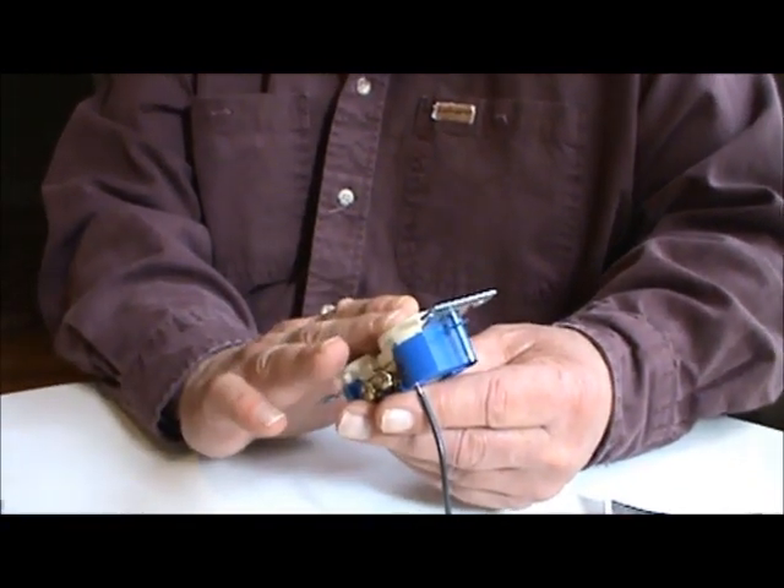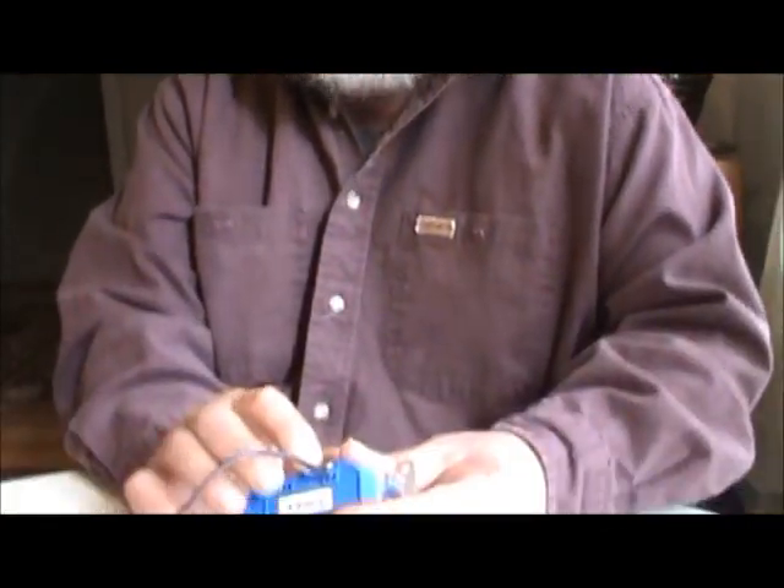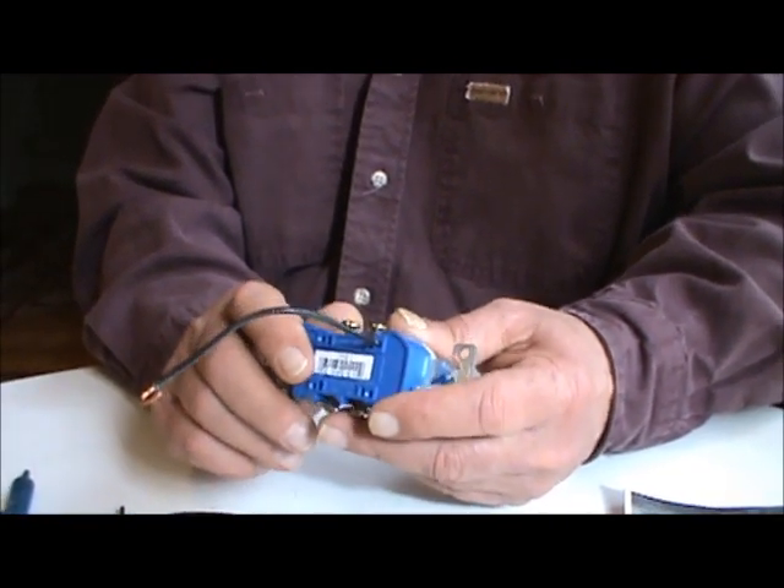So if they get warm to the touch, just make sure — if you've got something pulling that much ampacity — have your electrician come and run you a separate circuit to it. That way you're not overloading your receptacles or your wire size. A window unit will consume — the ampacity, all of them are different. Let's just say a 1500 watt heater: that's going to draw 12.5 amps. That's a lot of current going through each one of these little things. That's why when people are using a 1500 watt heater, I tell them to plug it into a 20 amp circuit — most times that's in the kitchen. But if you're doing them in a bedroom, only use a thousand watts of it. Then that'll be okay.